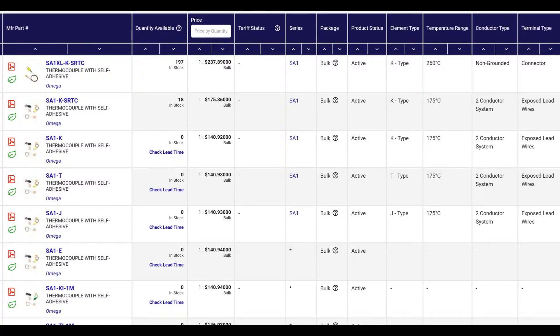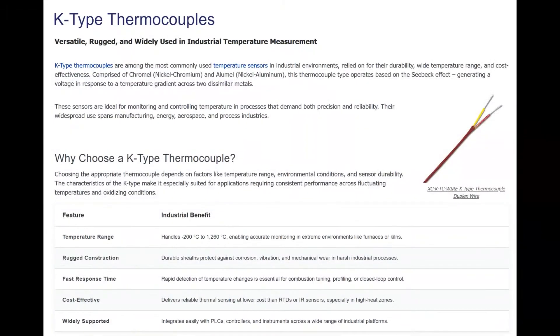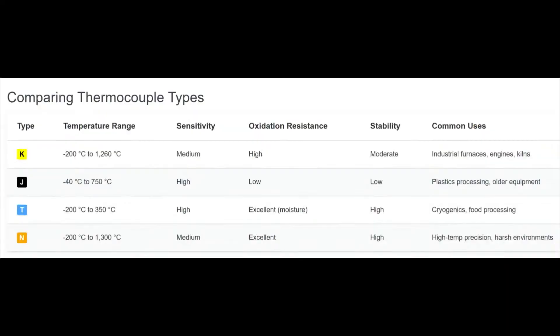There are a couple of different varieties of thermocouples available. The ones that DigiKey has in stock right now are K-Type — those are the two at the top. One comes with a standard thermocouple clip and the other has bare wires. K-Type is the most popular thermocouple, works at a wide temperature range, and almost every measurement device that takes thermocouples uses K-Type. However, other varieties — J, T, and N — are available for special order through DigiKey. Most people will be happy with K, but if you have a sensor calibrated for J, T, or N, ask DigiKey and they'll order the special version.